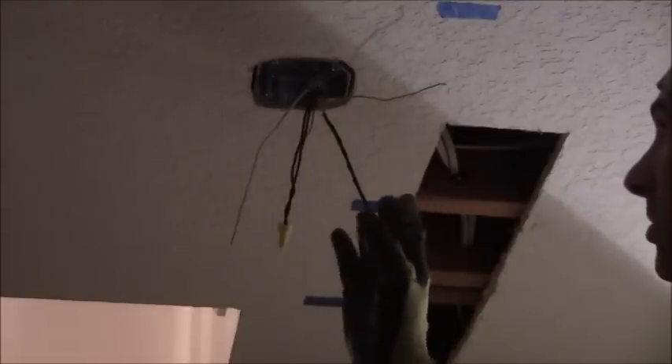I'm going to shut the switch off — I'm still hot here and I still have to fool with these wires, so I'm still going to go back and kill my breaker for now. I'm ready for my light fixture, but I think what I'm going to do is hold off because I have drywall repair here and I don't want to get the new fixture with any drywall repairs on it. So I'll wire-nut off this traveler in case the switch gets thrown, and just tuck the wires out of the way. But pretty much I'm ready to go for a light fixture at this time — I'm now controlled from that new switch location, which is once the drywall repairs get done, will be really nice.